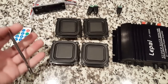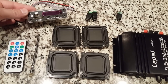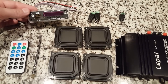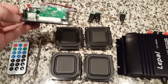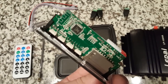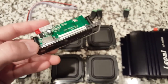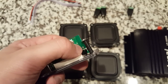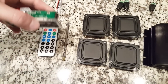I did buy an antenna — a very small one that will go on the side of the box. The reason I bought that is because of this little unit I bought from Amazon. People were complaining about it saying they can't get any FM channels. It has AM, FM, Bluetooth, USB, and an SD card, so I figured it has to have an antenna port somewhere. But if you look at it, it does not show an antenna port — it shows a mic port, but no antenna port. There is something on the back for Bluetooth, but that's not an actual antenna port. However, right by that screw, where it looks like you can solder something to — that's the antenna port. We'll solder a wire from that to the external antenna in order to get the AM/FM sound.